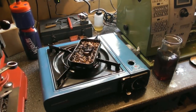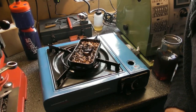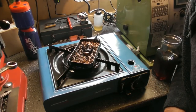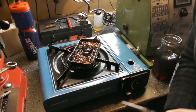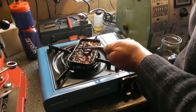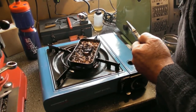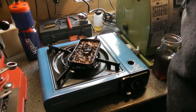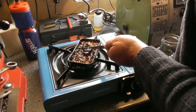I'll just leave it run. We're getting very close now. The one on the right is just fading from purple into blue; the one on the left is just going from dark straw into purple. I've realised that blue is the last colour — it's after purple. I was getting a bluey-purple with the last one. It's blueing more and more the longer I leave it. The secret is the bed of brass chippings — that gives it an even temperature so you get a consistent colour throughout the component. When I get to the point where it's as blue as I think it's going to get, I'm going to pull it out and drop it in a pot of oil.